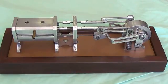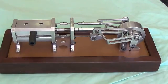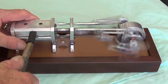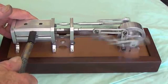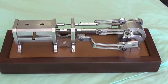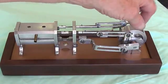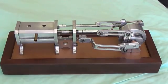Here we are with the two-cylinder steam engine. We'll do the same procedure — put the little piece of hose over the end to seal the air chuck and plug the air chuck against it. Let's see what happens. Wow, works pretty well. You can tell it's not in perfect balance. The knocking sound you heard is just exactly the same sound you'd hear in a car when a rod starts to knock. I don't have ball bearings or really bearing inserts in here — it's just simply steel axles going through holes in aluminum. So it slaps around a little bit. But it sure does work.